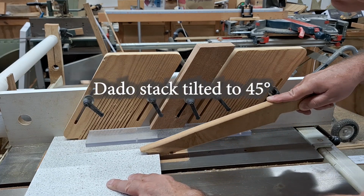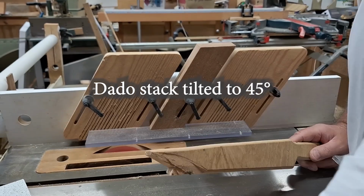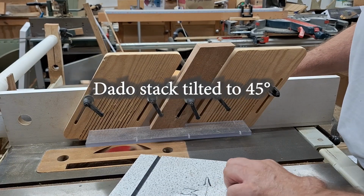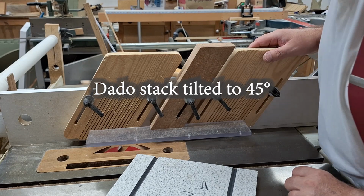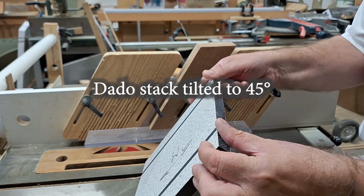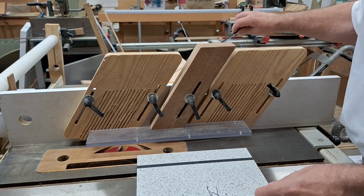In the past, I've always cut my V-grooves on the router table. But while that works very well, I always get a little flat at the bottom of the groove, which has to be dealt with, either by scraping out to a sharp corner, or by removing the arrises from the keys themselves. This HPL material is very hard indeed, and ordinary hand tools don't touch it.